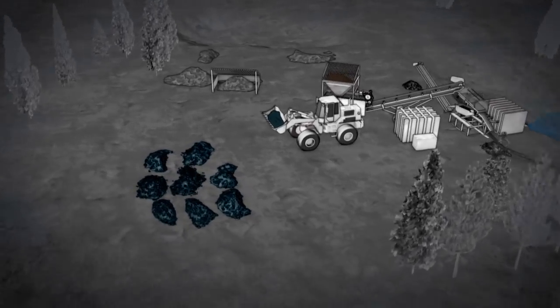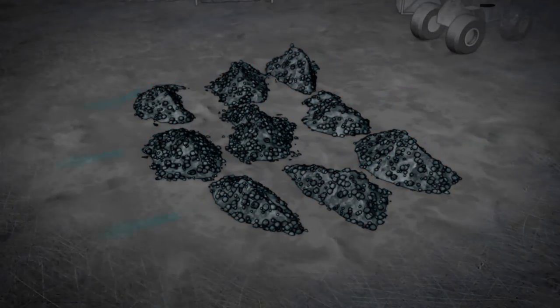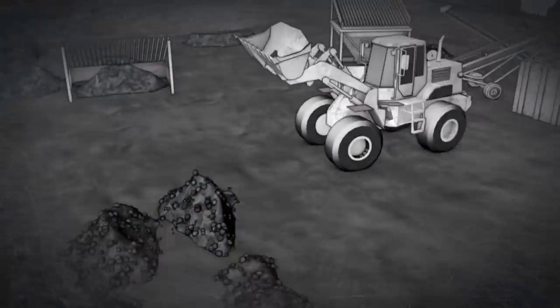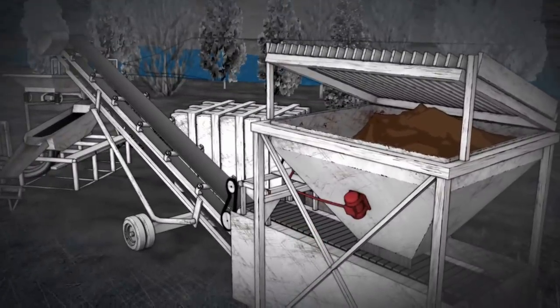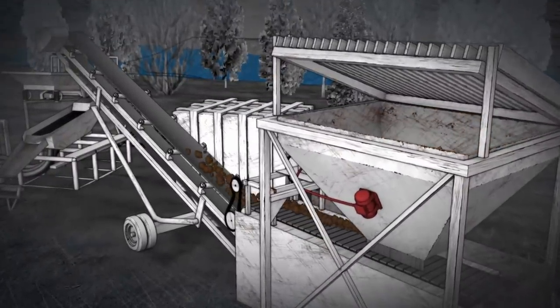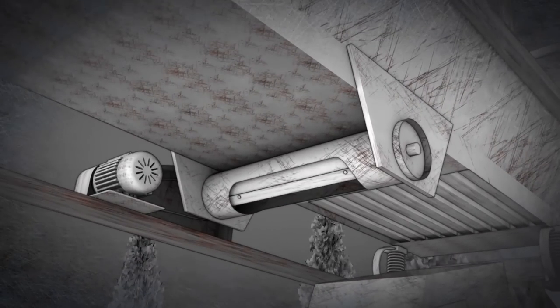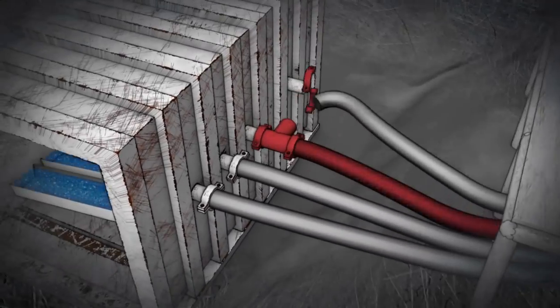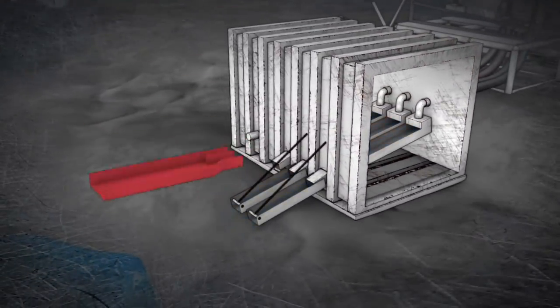Freddie and Juan plan to set out the pay into V-shaped piles called windrows to dry it out before going through the plant. Two vibrators on the hopper will stop any pay sticking to the walls. They will modify a counterweight on the pre-wash to help shake off any remaining pay. Finally, a new plumbing system will divert material away from the centrifugal bowl and into a brand new sluice box.